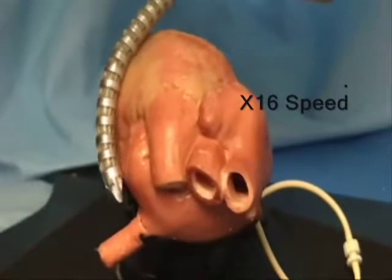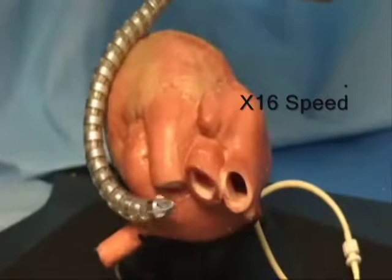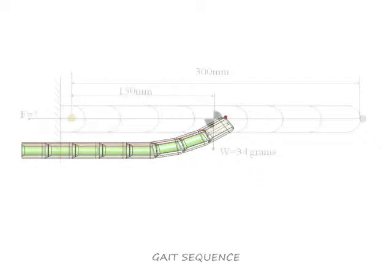A novel feature of the HARP is that it uses conventional motors. The HARP's design consists of two concentric tubes. Each tube comprises many plastic links strung together on strings. The two tubes can alternate between being rigid or limp, while the outer one can also direct the distal link. The HARP follows an arbitrary curve in three-dimensional space by alternating the rigidity and limpness of the outer and inner mechanisms.